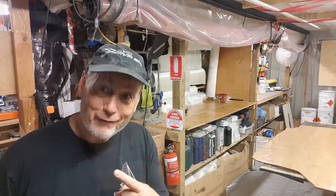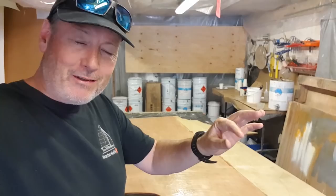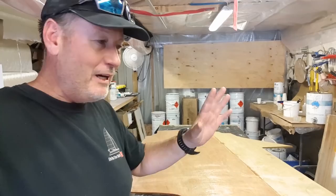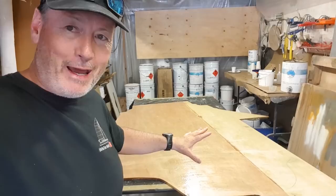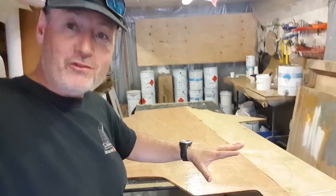As that sets, it's got a forced cure on there on a hot day, and I've got the fan blowing the styrene off. This has now gone off — you can touch it. I've given it a really light sand because I noticed a couple of little pieces of lint and fabric from the cloth I wiped it with. You can never be prepared enough. I vacuumed it twice before I did the acetone wipe, and I've still got lint on it. It's just going to become part of the cloth, but it's important — imperative, in fact — to get these bits of plywood and the resin dead flat so the next layer goes down with zero voids.